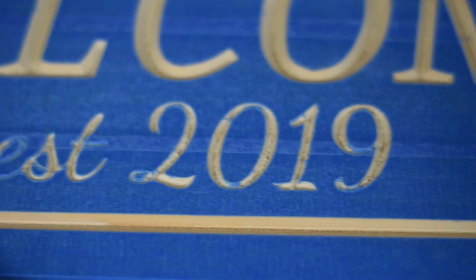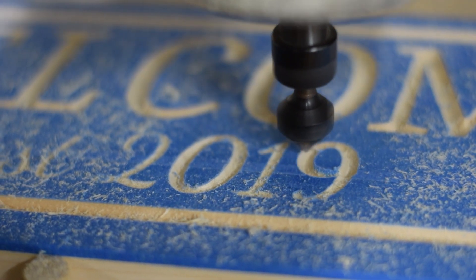Turn on the CNC and the router, hit start, and let it carve. My first pass didn't go quite as deep as I wanted — there just wasn't quite enough detail in the result. So I clicked it down a couple times on the Z manually and ran it again. The second pass came out pretty much perfect. I then took some 400 grit sandpaper and went over it just to get rid of some of the fuzzies that pop up from the blue tape. Vacuum that off and we're ready to start the finishing process.